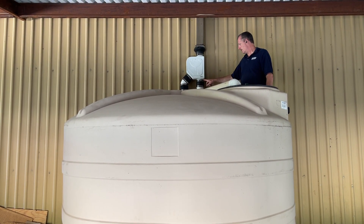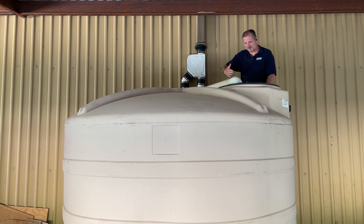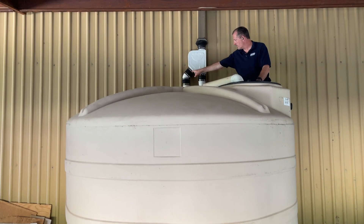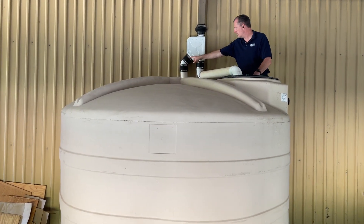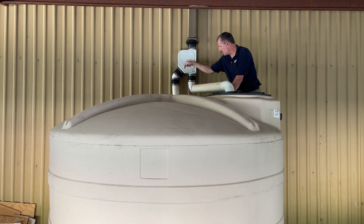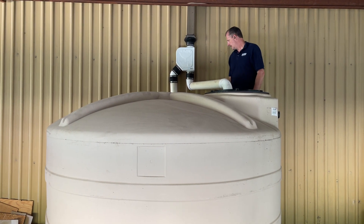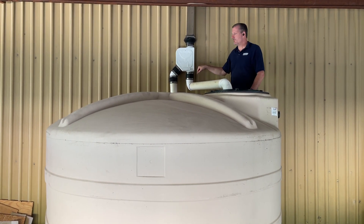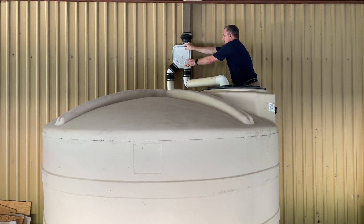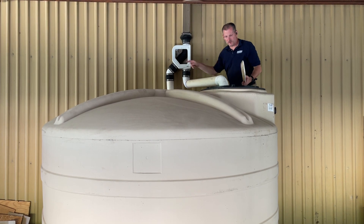There's one on the right where the clean water comes through this pipe at a slight angle and goes over into the top of the water tank. Then there's one at a 45-degree angle and a connection going straight down with four inch SDR lightweight PVC pipe — that's your discard water. So the filtered clean water goes into the tank and the discarded water goes out here.